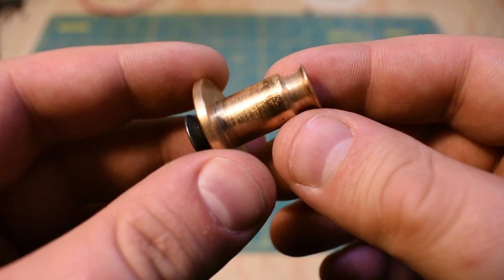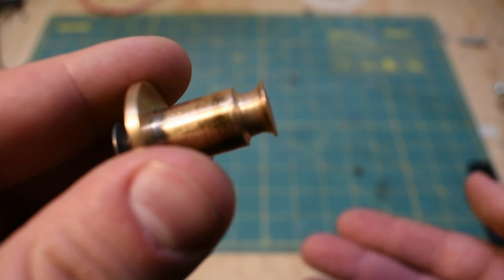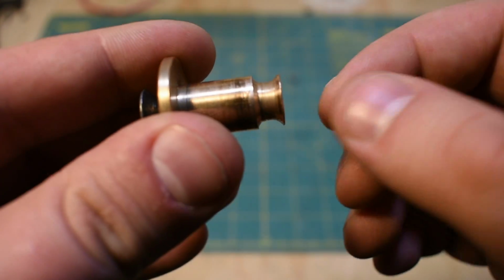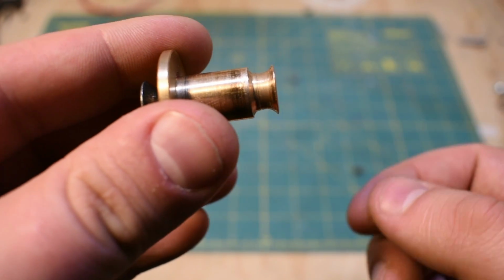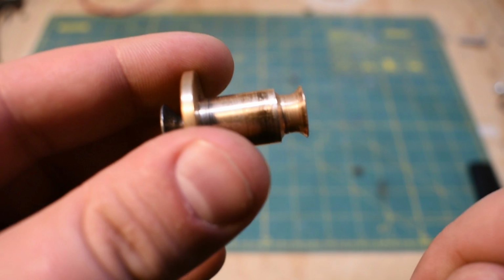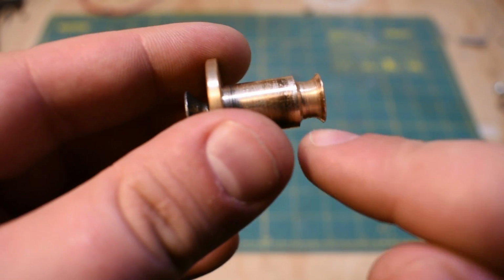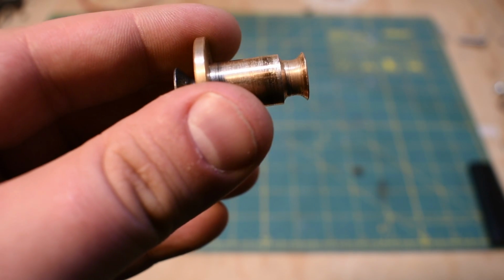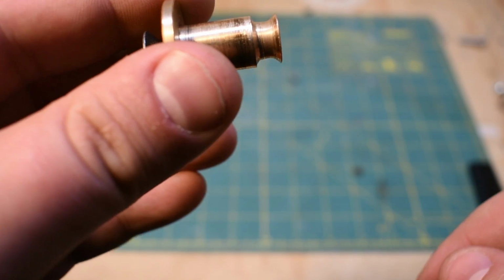This is the pivot. It's made out of an aluminum bronze. Like I mentioned in the last video, I basically just whittled out this part here. So that's not a perfect semicircle, but it works perfectly well. One thing I try to do when I design semicircular features on turned parts is to make them 6 millimeters in diameter. That way you can use standard circular inserts. Didn't do that here, so had to whittle it out.